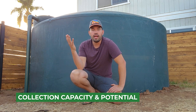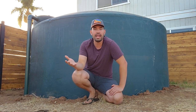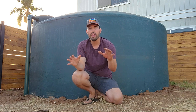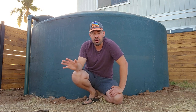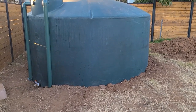Another question: how much can I actually store over the course of a year? The total capacity of the system is 5,700 gallons — 5,000 here, 500, and 200. In theory that's the max, but you'd never really store it all the way up. Especially here, where we get such little rain, I'd much rather keep it at 50 to 60% full and use it when I know rain is coming. Based on projections off all the surfaces water falls on my property — my roof, my shed, all the different roofs I have — you can get about 600 gallons for an inch of water off of 1,000 square feet. So based on the inches I get, we're somewhere around the 7,000 to 9,000 gallon range, which is more than my capacity. It's not some amazing amount, but I don't get a lot of rain, so I want to cherish and harvest as much as I can get.